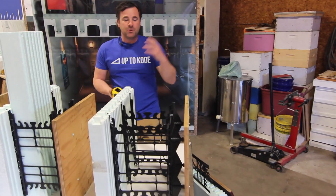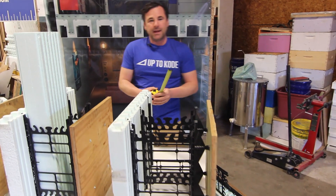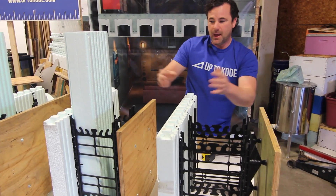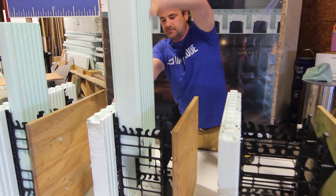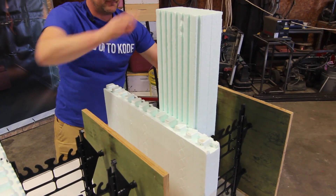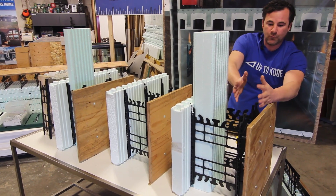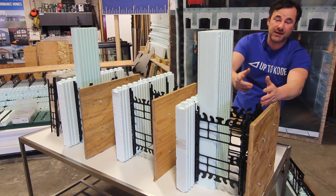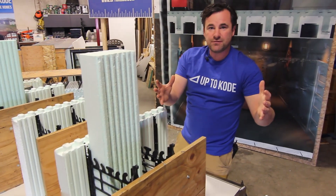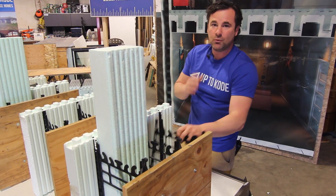You can keep doing this process. With a ten-inch web, you have a twelve and three-quarter inch wall. Depending on your situation, you might need an eight-inch or eight and five-eighths concrete core, and then you could slip in the four-inch insert. Say you had high backfill and needed a thicker wall — this still gives you an R28 with an eight and five-eighths concrete wall, more strength, and more thermal mass. Thermal mass — the weight of the concrete — adds capacity and storage for energy, whereas R-value just resists temperature transfer from one side of the wall to the other. We have videos more specifically on that.